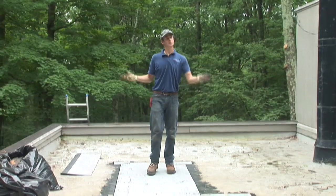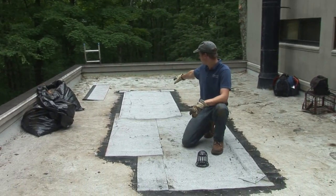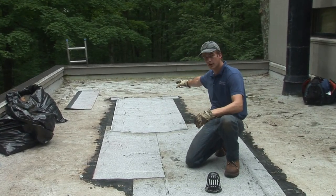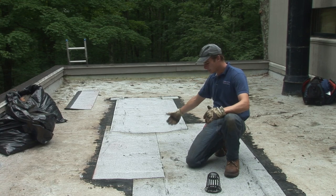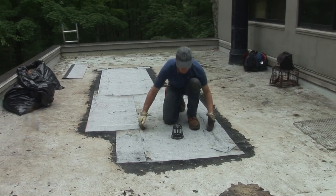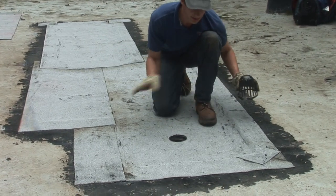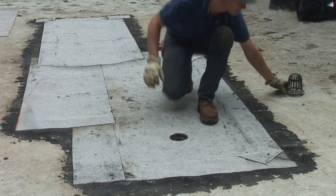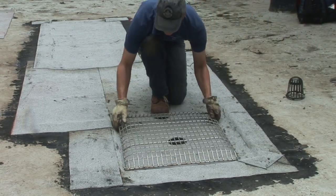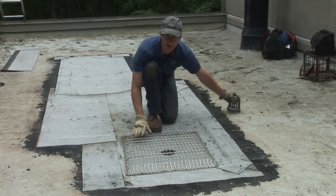Alright, we just finished the channel and it's starting to rain. You can see I made a channel through that hump over here. We lowered it where the puddle was so everything will collect there, then made a channel through the hump, lowered it all the way down here, and lowered the drain also. Another thing we did for the drain — we cleared out a square area around it. This is the original strainer, but to make this drain effective we made another strainer for it.